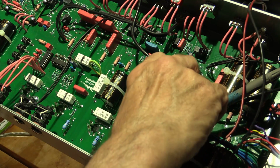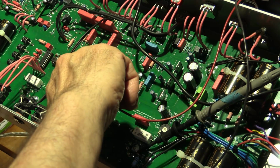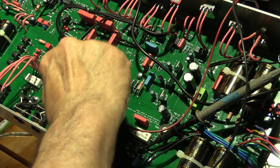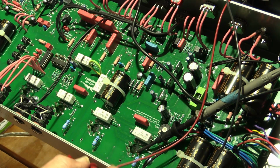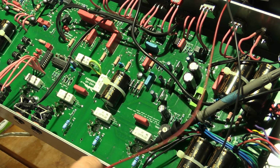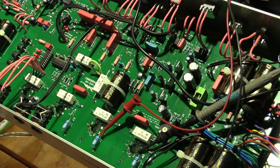So this one is 26 milliamps, 33 milliamps, 31 milliamps, and 28 milliamps. Okay, they're not properly matched. In a previous life, I may have suggested that we replace a pair of these tubes. In the current pricing, 26 to 34.